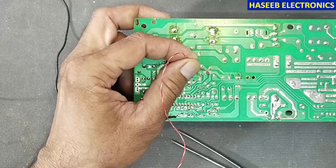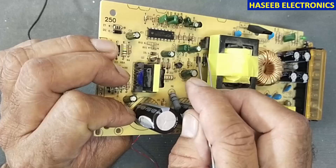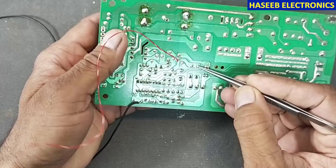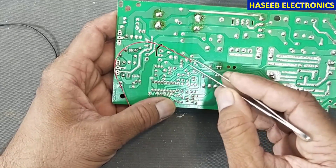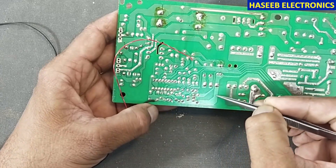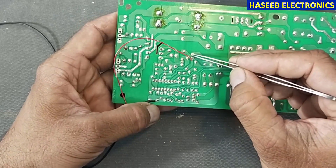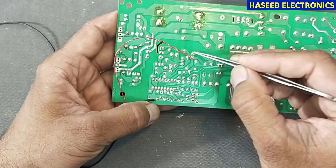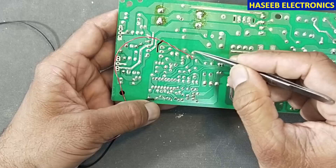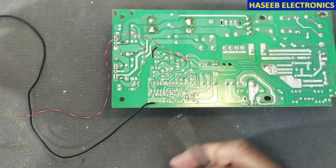We will connect at this capacitor so we will not make a short circuit between the IC pins. This is the VCC capacitor connected to the auxiliary winding output. Two rectifier diodes come to this capacitor, and this is the return line — the ground line — which we connected here. We can connect across this capacitor: ground here, ground here, positive here. We have jumpers.